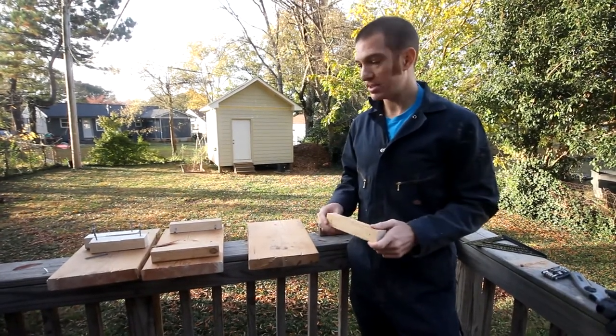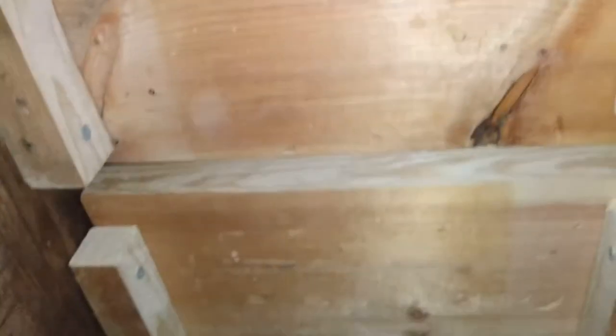I'm going to hop in this crawl space and get these installed. After letting the disinfectant solution dry overnight, we went ahead and installed these three sets of boards. I left about an inch and a half expansion gap between each one of them, and installed them as tightly to the subfloor as possible so there should be no movement in the future. This is a pretty sturdy solution, so even if the subfloor is a little compromised, these boards should be able to support it.